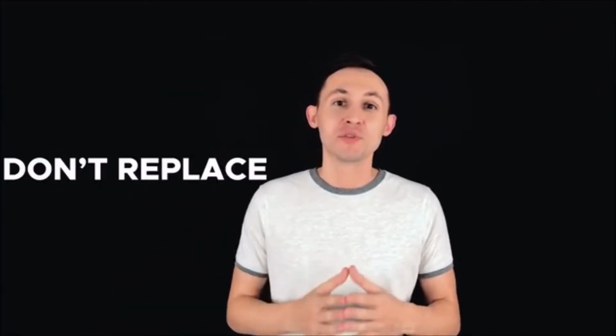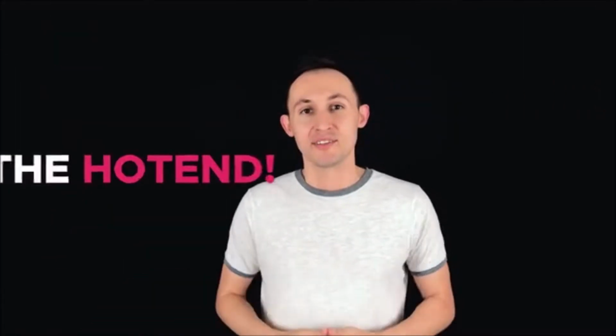On conducted tests, Nova could reliably print at up to 300 mm a second on a machine which was not able to go over 60 without quality loss or under extrusion. This machine also utilizes the most popular extruder type on the market and not a dual grip one. It's very important for the data, as I wanted to use a normal extruder type which most of you already have, and not a high performance one which could show the result that you won't be able to achieve on your machine. After the testing, the message was pretty clear. Don't replace your printer, replace the hotend.